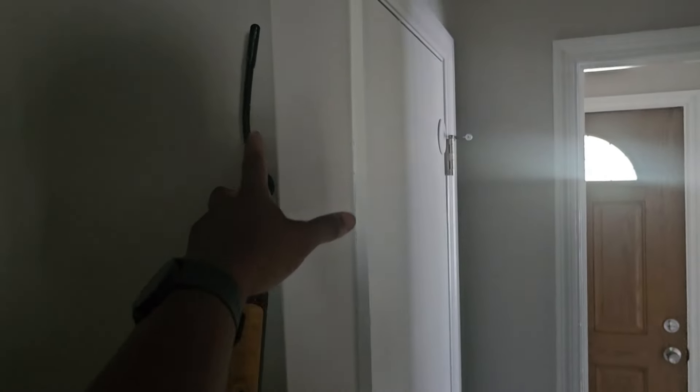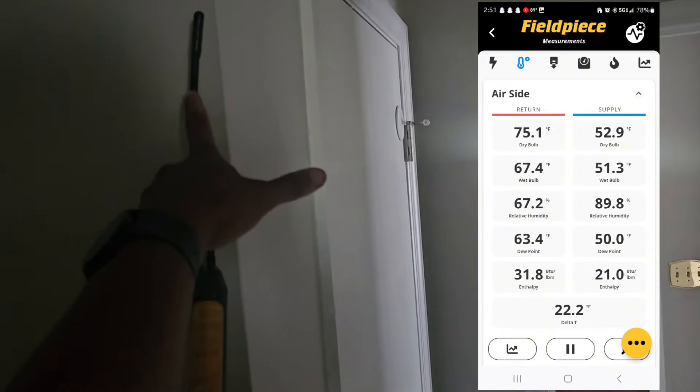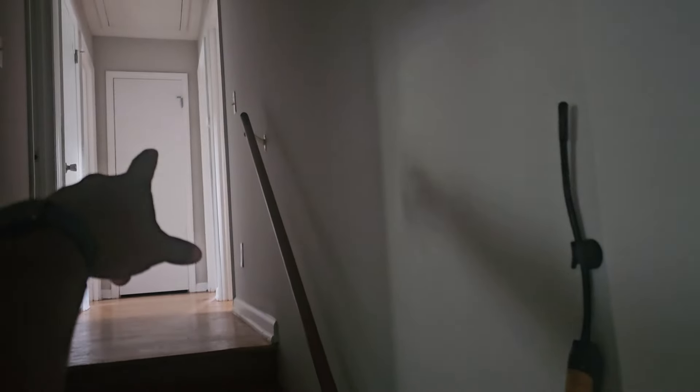They're going to get billed for this and I can't find anything wrong, but at least I've got things documented. This is the first time we've been to this property — I think they probably just bought it. The first delta-T reading I took was with my probe right on the filter grille, which read lower than the thermostat. I moved it away from the return and higher to see what temperature it would pull. Do you guys think they should have left the return in the stairs, or was the right move just doing this single one? I don't know, but it feels great in here.